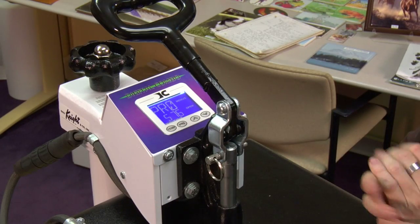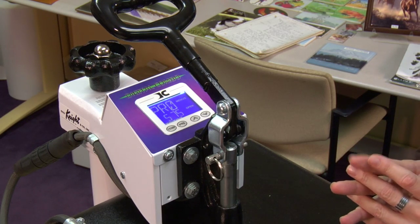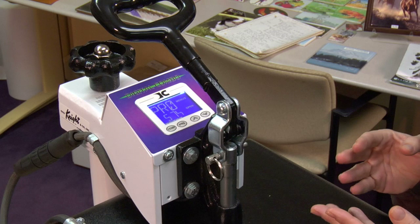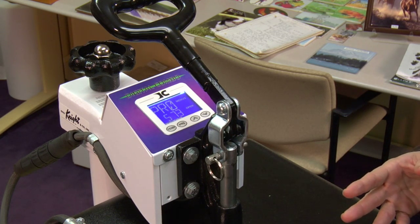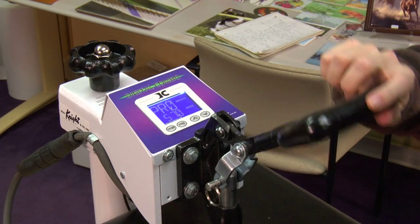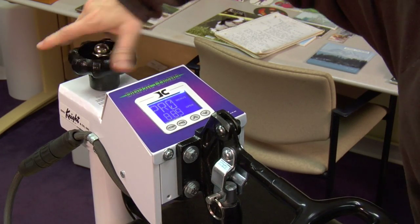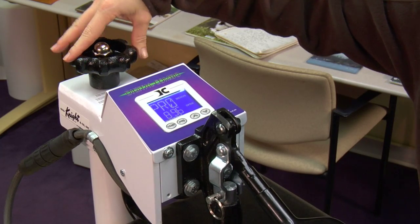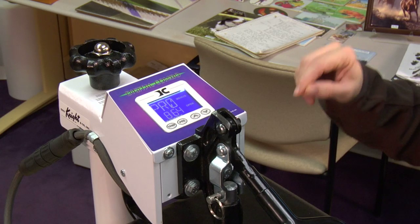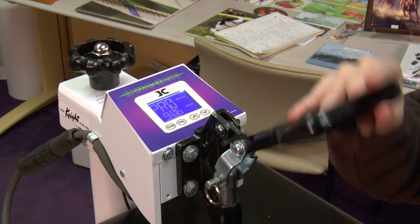We're in the user menu. Earlier we talked about PRO and PMX. The PRO is your low end of your pressure, which would be zero, and your PMX is your high end, which would be nine. We're going to calibrate that — we're going to say what zero is and what heavy pressure is. Close the press in PRO mode and adjust your pressure until the lever drops. Once you hear it drop, go about a half a turn back up. That would be set for the PRO, which is the minimum pressure. Use your arrow key to lock it in — that says it's zero. Raise it up and press the program key to go to the PMX.